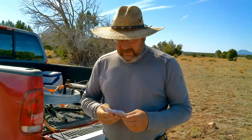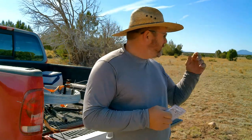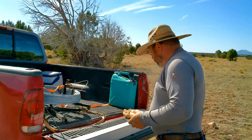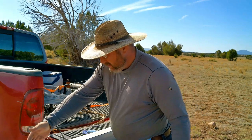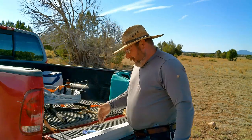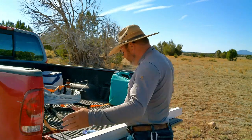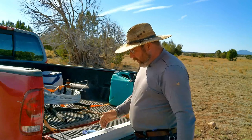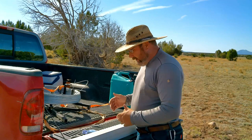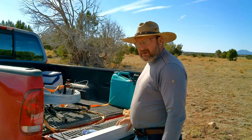These hinges are relatively cheap. About every corner on this place is not a perfect 90. So we're going to attach our hinge right above our 30-inch mark. That's where we set the post on a seven-foot corner. So we're going to mark 30 inches, put the hinge above it, and it matters how you mount the hinge. I'm going to take you through the process and show you how it works.